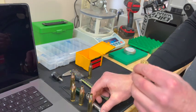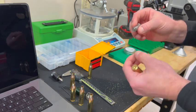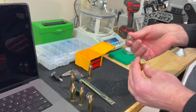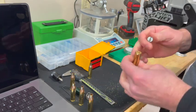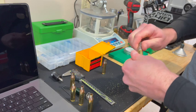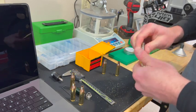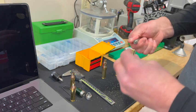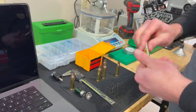The next step is to make sure the flash holes are nice and round by running this little hand reamer tool through the flash hole. I forget the actual dimension — I want to say it's 62 thousandths of an inch — but the dimension of this little reamer is what the primer flash hole should be. So we insert this and it just takes a couple of quick turns. It's actually cleaning out a little bit of material, which tells me these flash holes are on the smaller side — which isn't necessarily bad, but they can be inconsistent. Everything about this process is being consistent and meticulous.